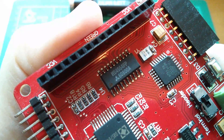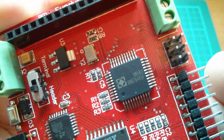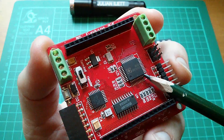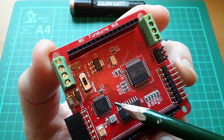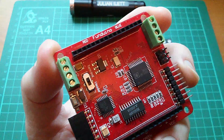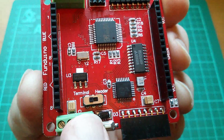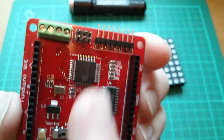We also have a M54564FP, and another chip which looks like a DM163. There's a 16 MHz crystal next to the DM163 chip and a 16 MHz ceramic resonator next to the ATmega328p. There's a 5-volt regulator, so possibly the input voltage could be higher than 5 volts. There's also a switch labeled terminal or header, which looks like it's connected through to the regulator — I suspect it's a power source selection switch, taking power from either the four-way terminal block or the header plug.